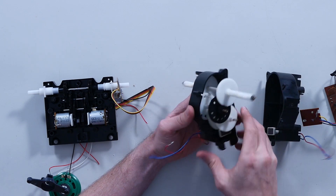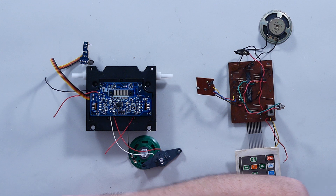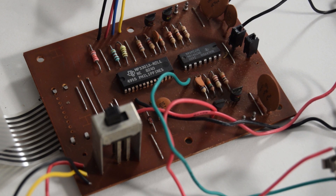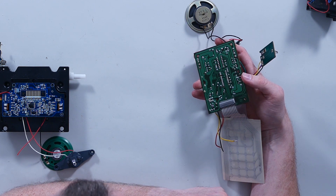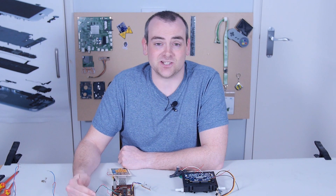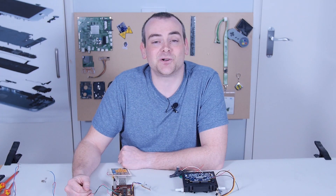In terms of the circuitry and manufacture of the circuit boards, the modern version is surface-mount components, probably wave-soldered, with nothing particularly challenging. But compare that to the 1979 board — everything's through-hole, and this is potentially hand-soldered. I love the fact they managed to get their custom mark on the traces in the PCB on the underside, which presumably nobody would ever have seen. It's a lovely board, really nicely made. On here we have the Texas Instruments processor which did most of the work, and then a little RAM chip just to hold your 16-line program. I've really enjoyed seeing the difference that 40 years of manufacturing and technology has made to these machines, and I'm surprised at how much is still really similar or even the same. If you've got an idea for something you'd like to see torn down, let us know over at the Element 14 community. Thank you for watching, and we'll see you next time.